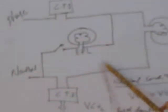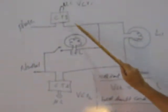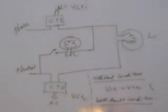But when we switch on the second bulb, that means an arc fault occurs. So current is directly going to neutral from this load, and current is not going to neutral via the second current transformer. This is our second bulb, which we can switch on by using this switch. Now, voltage to current transformer 1 is greater than voltage to current transformer 2. We can find that arc fault is detected. Now let's check it out in this circuit diagram.